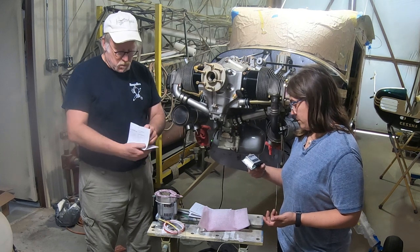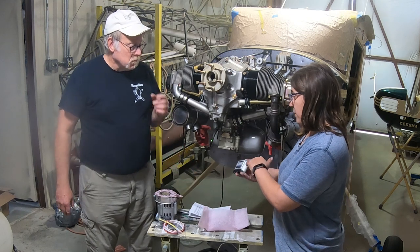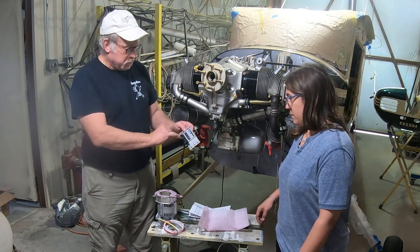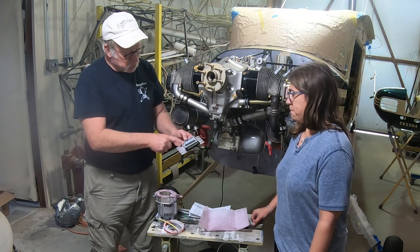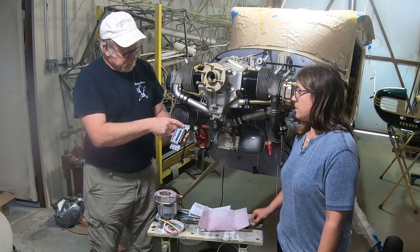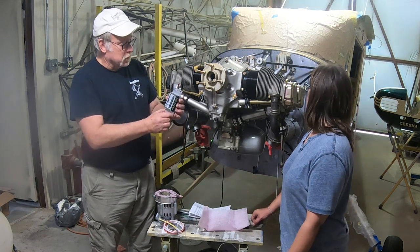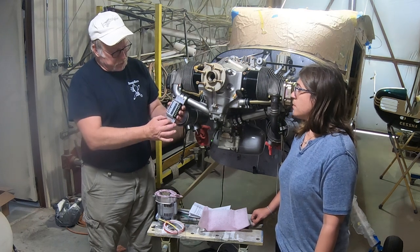Okay, cool. It looks like it's a standard case for 28 or 14 volt, and they just mark your application. The other thing that's neat too, which is nice, better than some of the older ones, is all your connections are labeled as to which one is which. Very easy. The other thing that's nice on this, which mine was not, is they've changed these to full size bolt holes. So on yours, you're just going to remove your existing regulator and go into the standard Delco Remy 2-in-1.